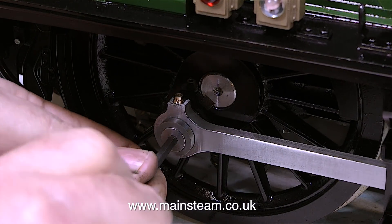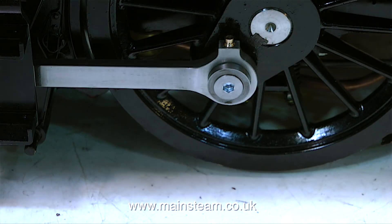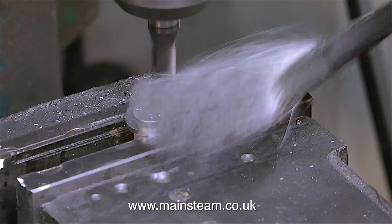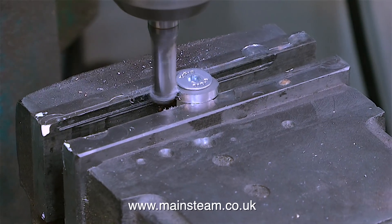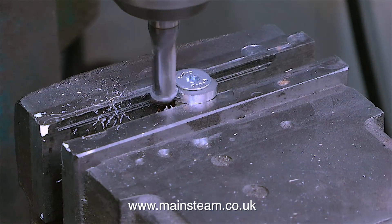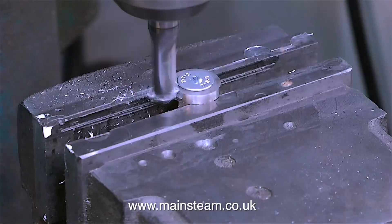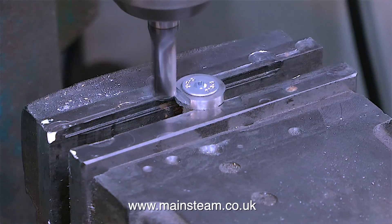Moving down to the bottom part of the engine, it's now time to do a bit of machining on the coupling rod retainers that I made in the last episode. They look okay as they are, but I need to make them look more scale-like. So what I'm going to do is machine a flat down each side of them. For that, I'm using one of the original countersunk bolts, which holds the countersunk washer very tightly to a nut held in the machine vise. Apart from machining off the writing, I also machined the diameter slightly less, in an attempt to make the bolt head look more like the end of the crank pin, because that's what it appears to be on a photograph of the full-sized item. In the milling operation, I'm going very close to the bolt, but when I fit the actual machined bolts back in place, there'll be a little bit more clearance from the end of the bolt to the flat I've created with the milling machine.